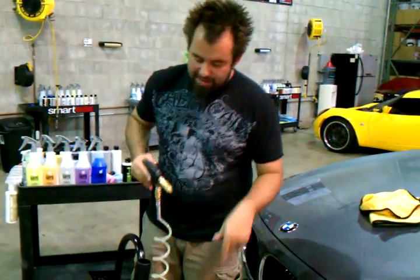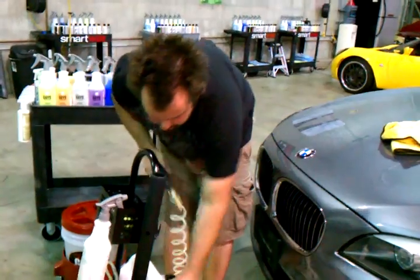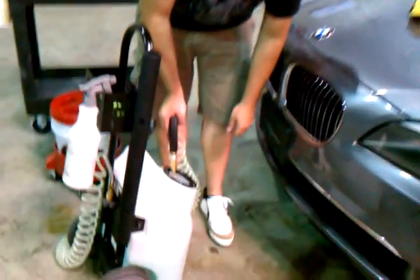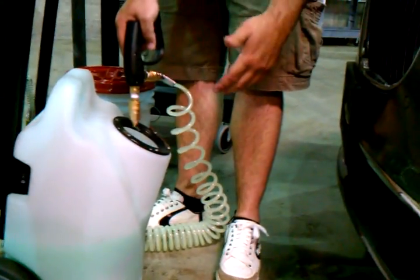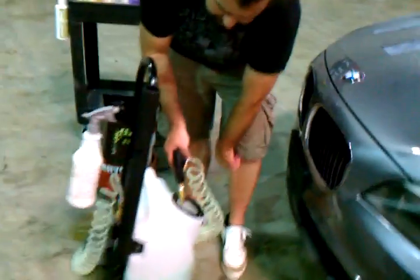Now when you're done with it, what we like to do, we always recommend customers turn off your unit and take all the pressure out of the line. If you notice, a nice PSI will stay in the line. That'll prevent the unit from accumulating pressure and eventually leaking.